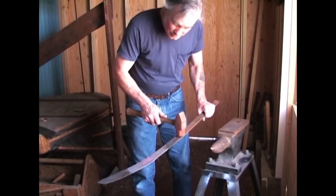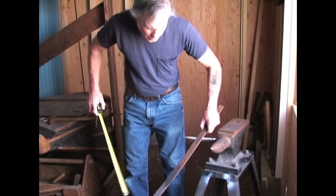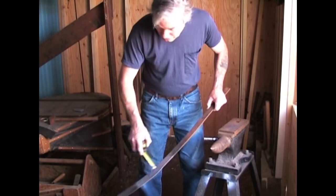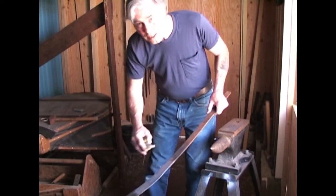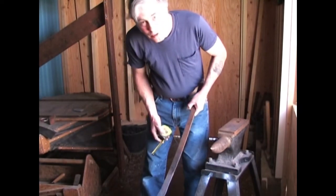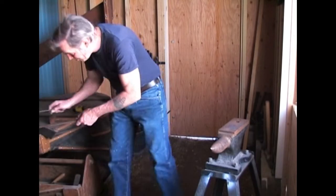I'm going to start working on this until I've got it forged out to about 24 inches long. As soon as it cools down to dull red you can feel the metal getting harder and it's just not going anywhere, so you've got to go back in the fire. Once I get it forged to the length I want I'll go back over the edge to thin it out, because anything I can hammer out saves time grinding. I'd rather hammer than grind, actually. Then I'll work back and refine my curve.